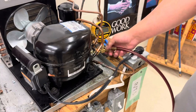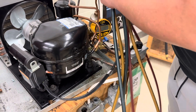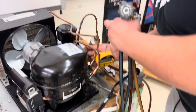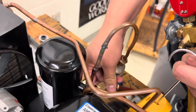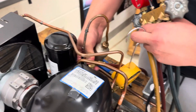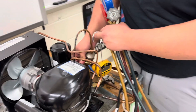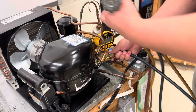You've got the wrong color hose — do better. Look at that pain in the butt. That's where they put the filter dryer right in the way of the service valve. I do not recommend that when they're redoing work. That's probably got to be swapped out, changed, and fixed as well, because you can see how difficult it is for the hands to get back in that area, and you still got to get a wrench in there.